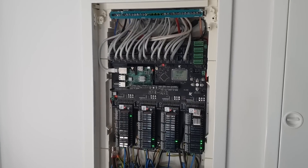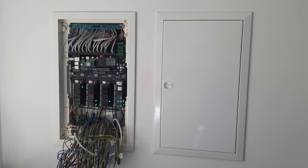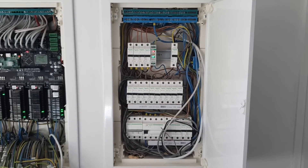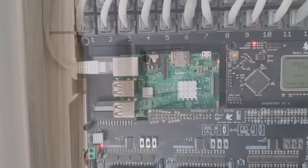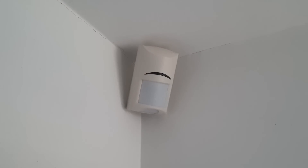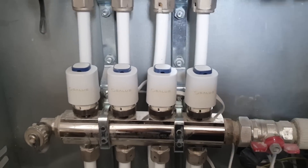Let me know in the comments what you think about this format on my channel. Should I do more such videos between subsequent projects or should I focus only on completed devices? Alright, let's finally get started. My main goal was to create a centralized system — at least its wired part. That's why almost all cables in my home are linked in these two boxes. In this one there are fuses. In this one is located the main control unit, the Raspberry Pi with Home Assistant on board. Here, information from all switches, windows, doors and presence sensors are collected, and here the mains voltage to supply all receivers such as lights, outlets, heating and so on are controlled.